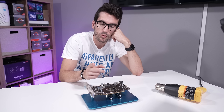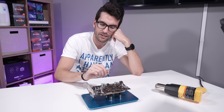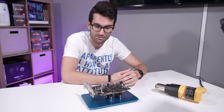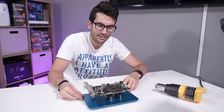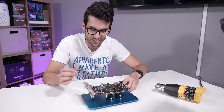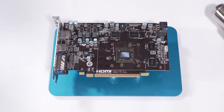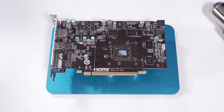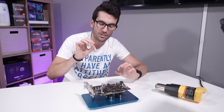We're back to about 100 degrees Celsius now, so about halfway there. One more thing while we're waiting: what we're doing here is not a guaranteed fix, and this also assumes that the GPU is the problem — it's not the only possibility. This is another reason why I don't think you should just start blasting these cards with hot air or throwing them in ovens. It just shouldn't be the first thing you jump to if you're suddenly not getting picture out. It could be a dead short somewhere, or a physical problem on the board I just haven't seen. Those are all easier to address in some respects. If you blast this thing with hot air, you could create a problem that didn't already exist.